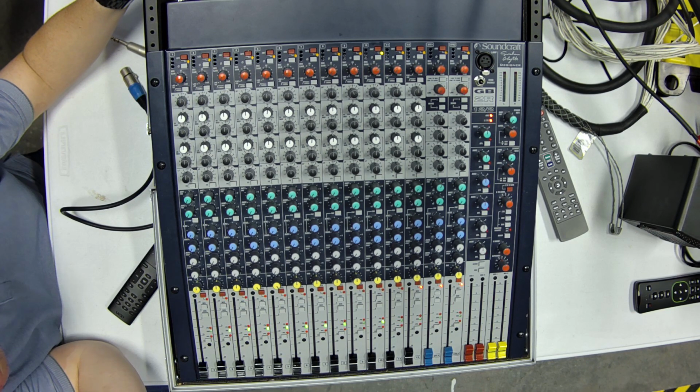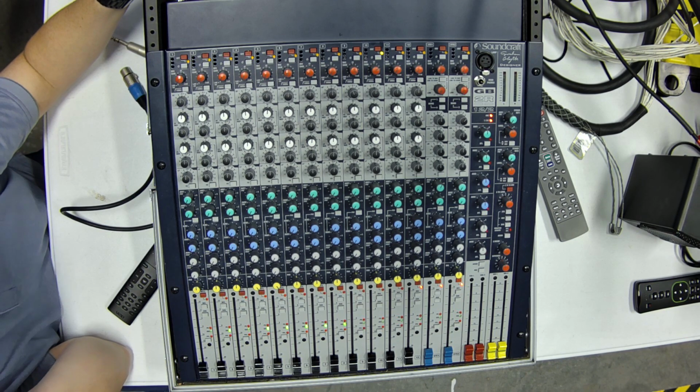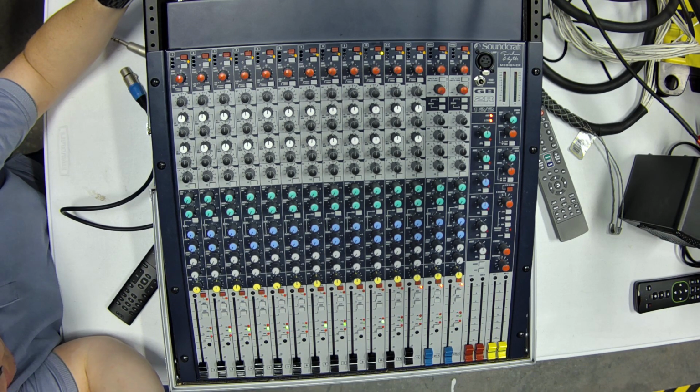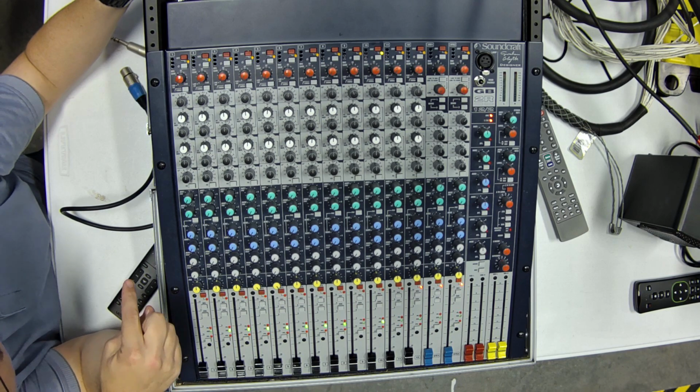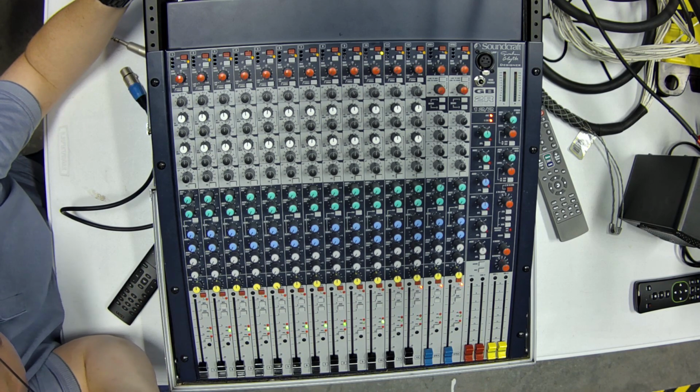So there are four kinds of audio analog signals that you will encounter. And the difference is basically their voltage. So you have microphone level. Okay. See if my question is answered. So you have microphone level, and microphones tend to operate in a certain range of voltages, and I've mentioned what those ranges are measured in a minute ago. Do you remember what that was? Millivolts. Literally tiny, tiny, tiny volts.